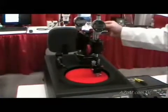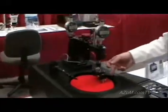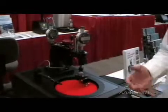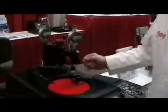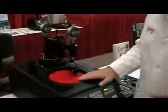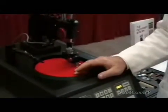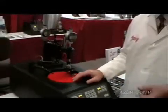A vertical adjustment knob at the rear of the machine allows you to advance or lower the sample into the abrasive, accommodating samples of very different heights due to the large stroke at the back. The sample is essentially advanced into a moving or stationary grinding wheel. In this case this is a polishing cloth surface, but lapping films and abrasive discs of different sizes can be used according to the material and the surface area that you're trying to grind.